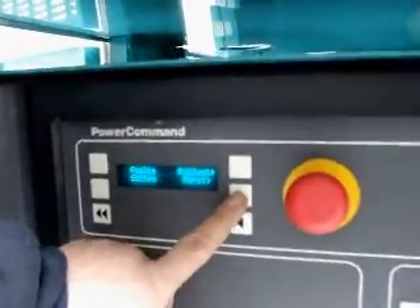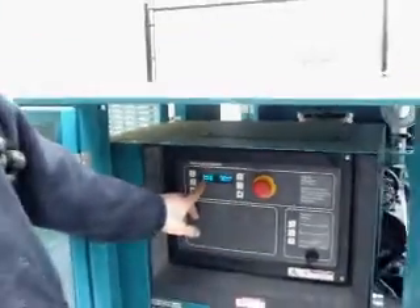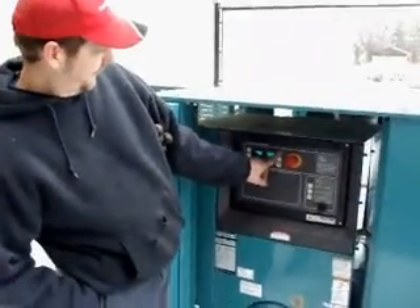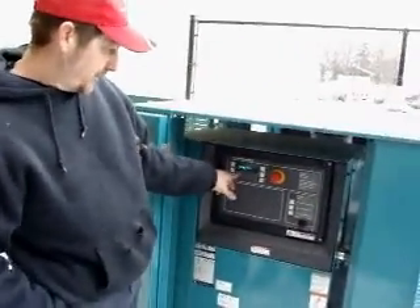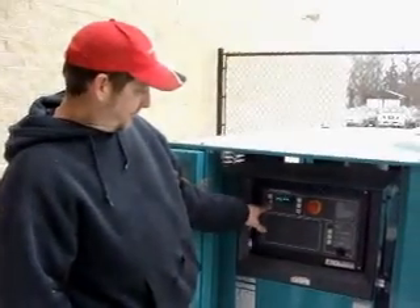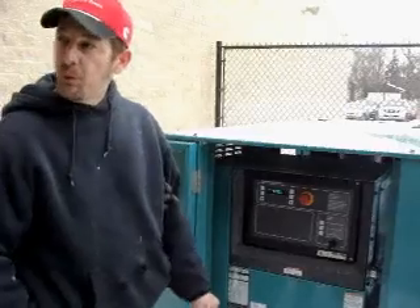It's like little ladder diagrams you can get to each of whatever you want. You press 'more.' It comes up: faults, system, history, and more. You want to hit the history button. As of right now, it's telling you that it started 24 times since its day of conception, and right now it has 11.1 hours on it.